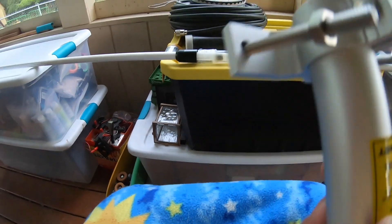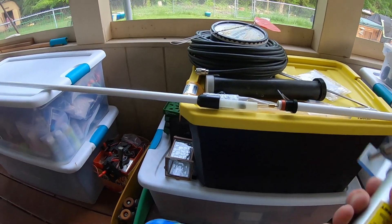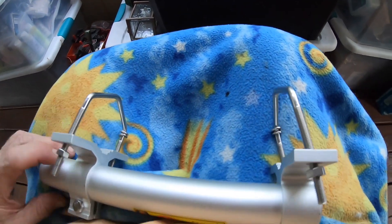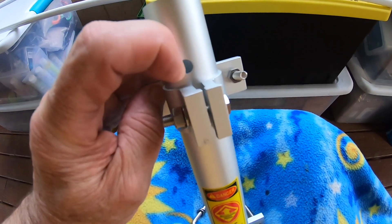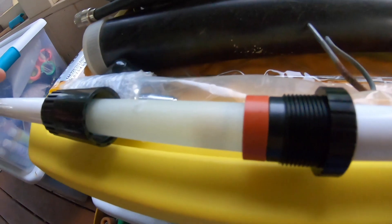This is what the mounting mast looks like — it attaches to the top of your mast or tower for the whole antenna when it's done. Right now we're just joining the two pieces together. That one clamp is going to go above that bolt hole, because that bolt hole will rigidly hold it to the base of the antenna. Now we're getting ready to join these two together and push them in. Then we just screw and tighten that all together.